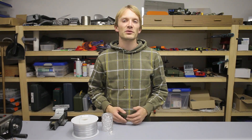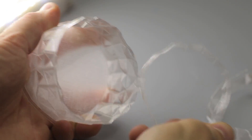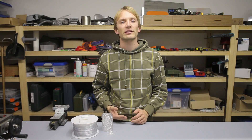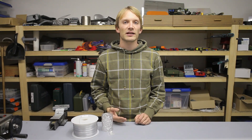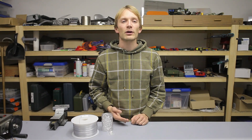But that also means that you'll have to print polycarbonate at much higher temperatures. You can extrude it as cold as 260 degrees Celsius, but at that temperature it has almost no layer adhesion. So realistically, you'll be printing polycarbonate beyond 300 degrees Celsius, which simply isn't something that normal hotends that use PTFE or PEEK in the heated parts can handle. I mostly use 350 degrees Celsius. You will need an all-metal hotend and possibly a specialized thermistor, since even the stock thermistor of the E3D V6 is only rated for up to 300 degrees Celsius.